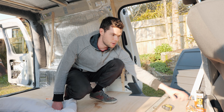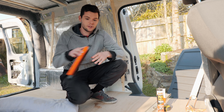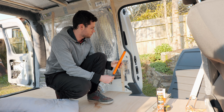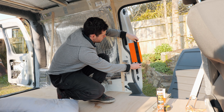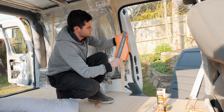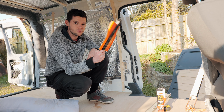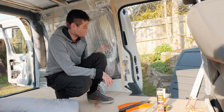I've finished doing the battens with the wooden frame and the next step is to add the cladding. What you're going to need is your cladding, a tape measure, and I'm going to use No More Nails to stick it on. Also another handy tool is this — I don't actually know what it's called, I'll find out and drop it in the description. This tool lets you get around the curve — you push it on, lock it into place, and then use that to draw on your wood so you've got the curvature to cut to.